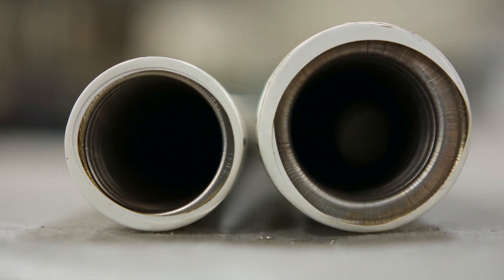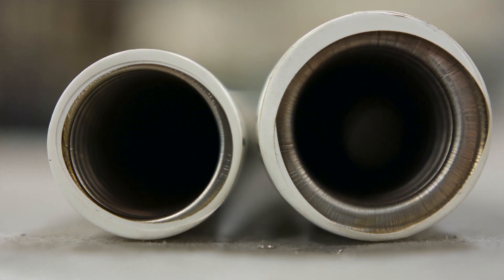That sounds so much better than just saying trial and error. If you don't know which direction to go, consider trying two different hoses — one on either end of the flexible versus stiff spectrum: a compressed P3 hose for the most flexible extreme, and an 800 series open pitch hose for the stiff, heavy extreme. Monitor them carefully after installation to see how long they last. Your present hose may also be hitting its resonant natural frequency, which causes it to stress itself to death. Changing the mass or stiffness could change it enough so the application's vibration does not affect the new hose in the same negative way. Hopefully one of the prototypes will perform clearly better than the other and lead you in the right direction.